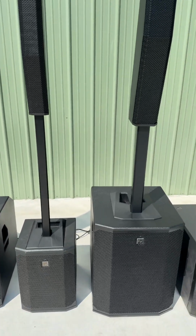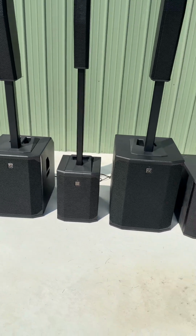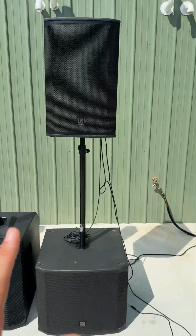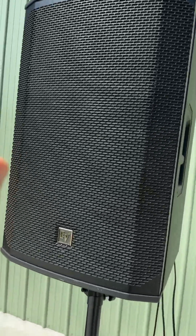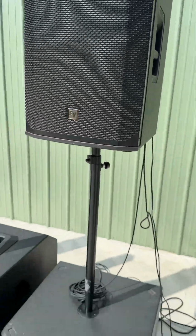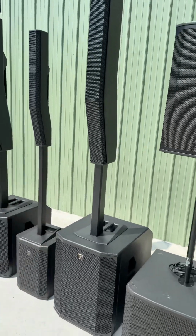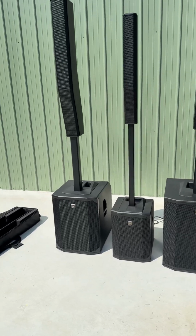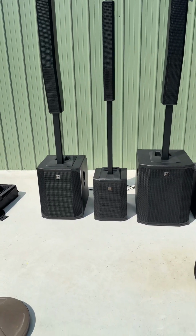But the speakers themselves are straight out. They're just super wide dispersion themselves. And then, yeah, I guess with that, this is a 60 by 90 dispersion, I believe. So 60 vertical, 90 horizontal. So you're getting half the dispersion from this as opposed to 120. Or, I guess not quite half.